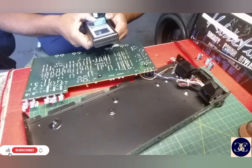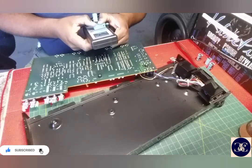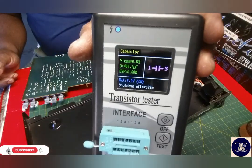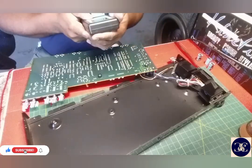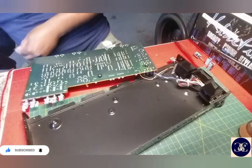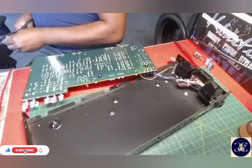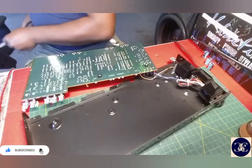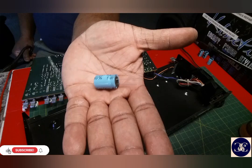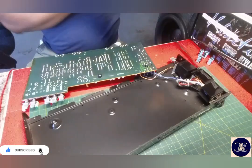Yeah, I know it would say that because it wasn't properly seated down. So this says 455 microfarad. 455 uF. So that's in range. So yeah, perfect. The voltage is up, so that's not a big deal. The microfarad was way too high. Cut these pin legs off. Yeah, you can see guys, these are new. Brand new.